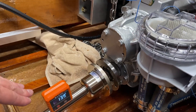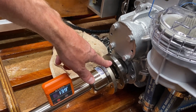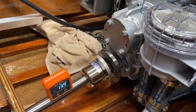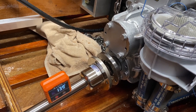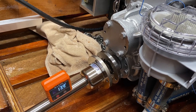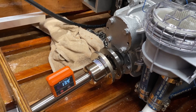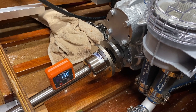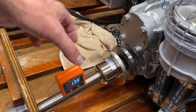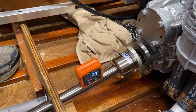So what I'll do is make sure this is held up, then adjust the engine alignment — I'll push the shaft all the way up metal to metal to get the engine alignment done. Then you pull the shaft back a little bit, put the transom saver in, make sure the engine is tightened and bolted down with the engine mounts secured. Once you pull it out, put the transom saver in, and bolt it back — it'll still be aligned. That's how that works.